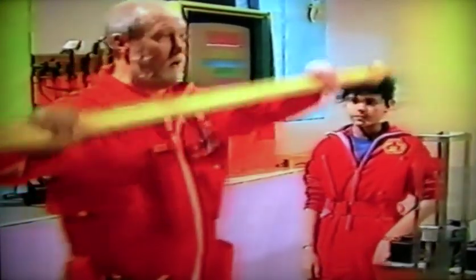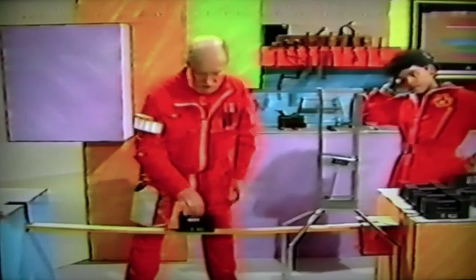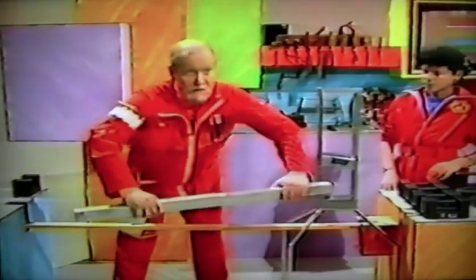First I'll give it the head test. See how it bends? This piece of wood bends. It won't bend this way because the wood is stronger in depth - beams have to have some depth. It's stronger that way than this way. But let's try it on the testing device. This is a five kilo weight onto this piece of timber. Look - it's elastic, it moves. It's not rigid like stone. It's not so good in compression, but it's better in tension. Last week, about 40 kilos broke the stone.